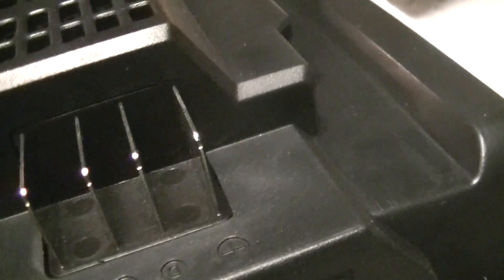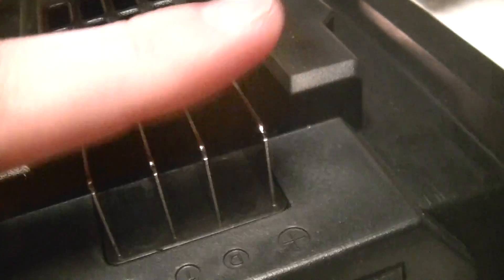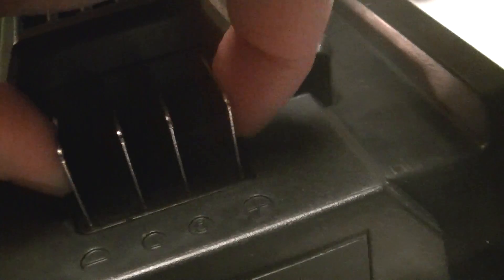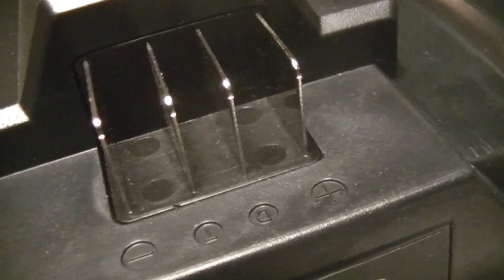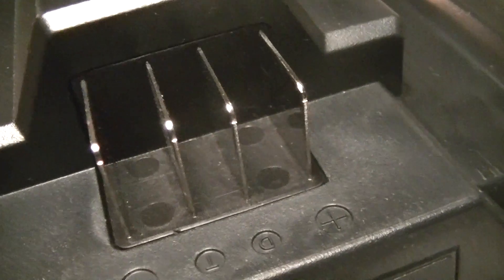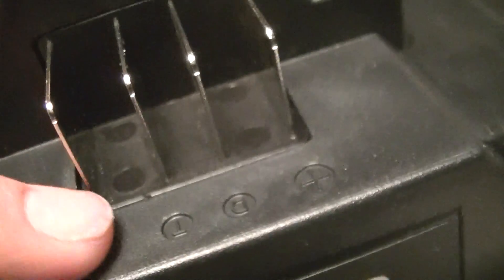There are a number of isolation slots on the board, which is good to see, because the charging terminals on the unit are completely exposed. That's obviously another reason for the isolation, because otherwise 56 to 60 volts is well within the realm of posing a risk of electrocution.